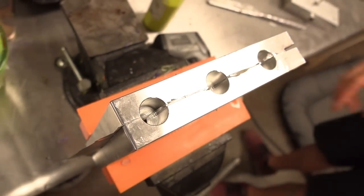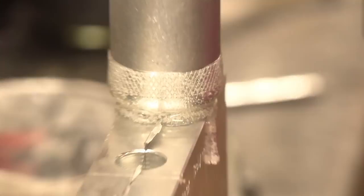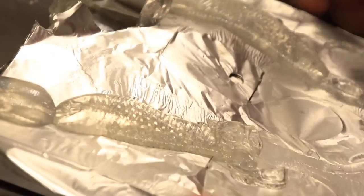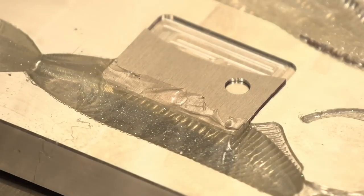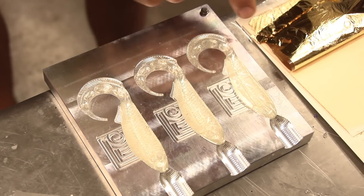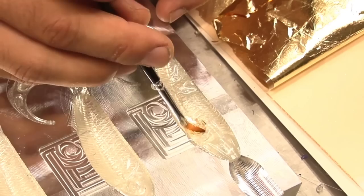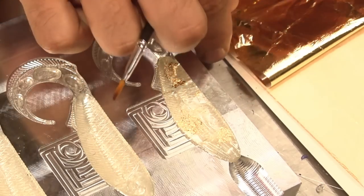Jason clamped a piece of foil between the mold — the two halves. We're shooting this now at like 310 degrees. Shot nice — I was worried about the venting. Those are halves, nice and translucent — we can do stuff to those. We're thinking these baits deserve real gold in them. Sometimes people take a brush and put gold on, so we're gonna try that — push it around. This might look really funky. It's like crackle paint. Put some in the tail — hopefully a gar doesn't bite this tail off first cast.